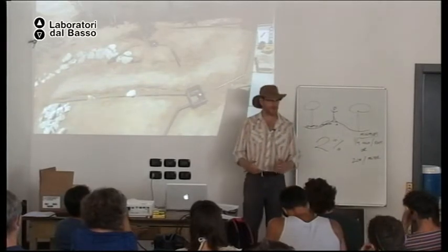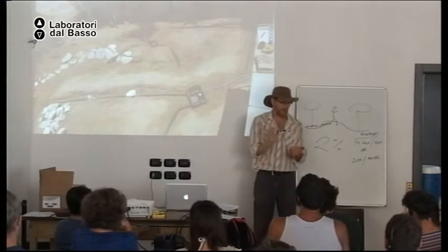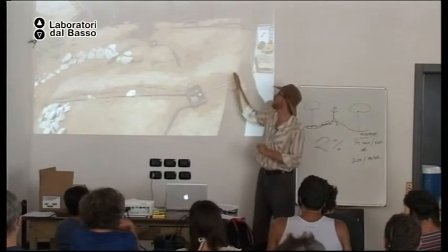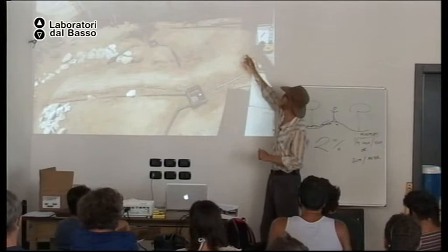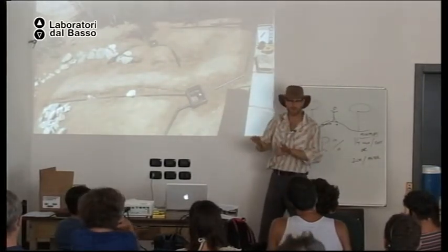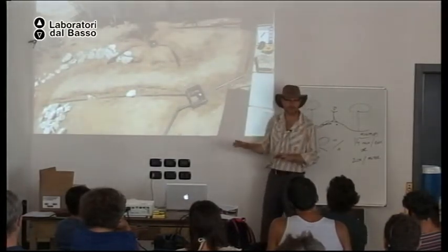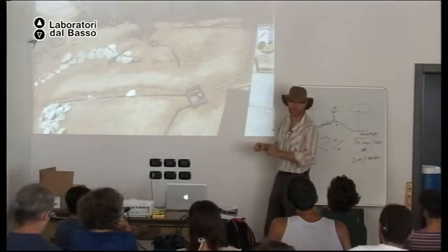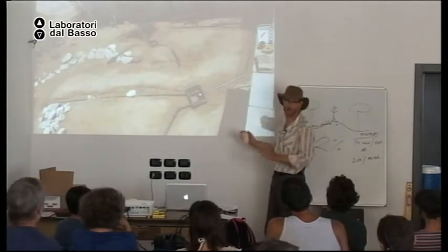Because it takes a long time making sure your slope is right. Okay? So when I put this system in, I dry fit the system. I connect it all with no glue. Okay? I make sure it's good. And I'll check my levels. And if all is good, then